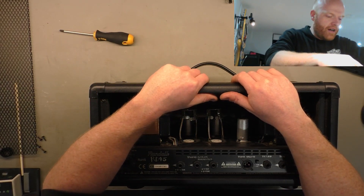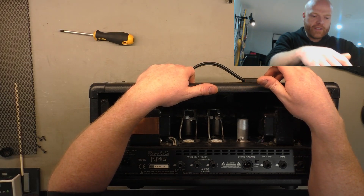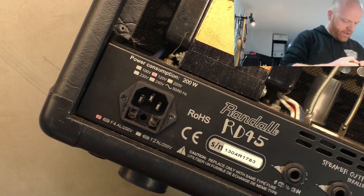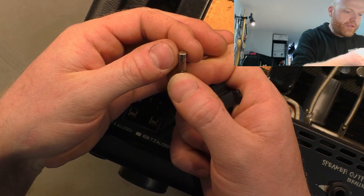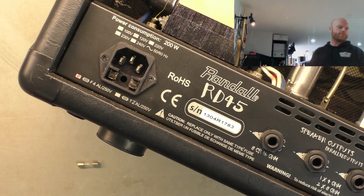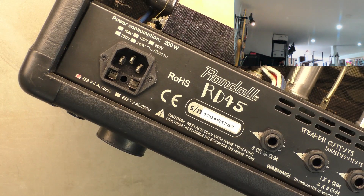He said just give it a check and service as well. I don't think he's even powered it on because it's still set up for 120 volts. So we'll go over the whole thing and check what's required to make it sweet. Before we even take the chassis out, check the fuse - it looks intact and it is 4 amps indeed, 250 volts, fast blow. F4, yep, so that's to spec. Just give it a quick continuity check - the mains fuse is still intact. I dare say with the loss of vacuum though, the HT will be gone, if there is one.